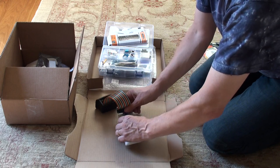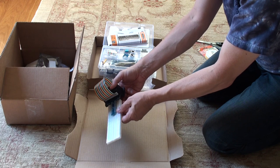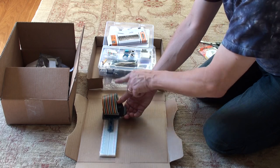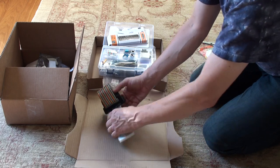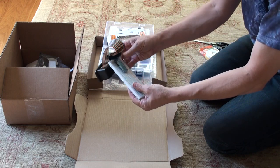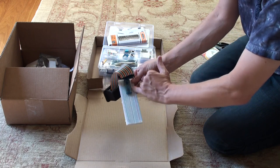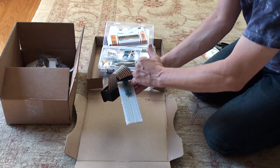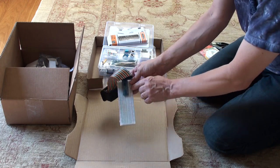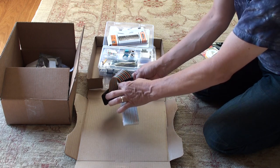Just one of the finer points about connecting the cobbler. Notice the way the cable is set up — when it's correctly connected, you should have this loop in it, so that it's coming across this way. When you put the cobbler on, if you center it side to side, you should have two rows of holes on each side of the breadboard, so you can make up to two connections to each of the pins. If you put it over too far, then you'll only have one row, which isn't as great, so put it in the center side to side.